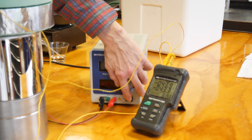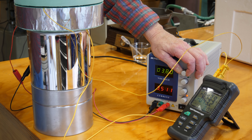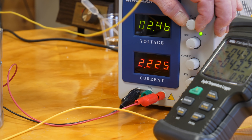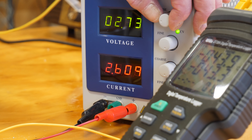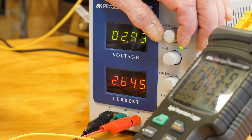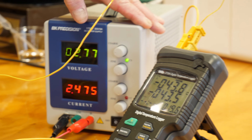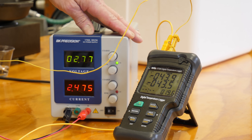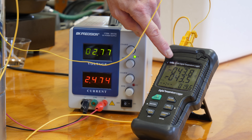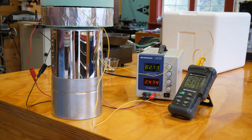The temperature is just about at equilibrium, so I'm going to turn on the power supply. Because resistance goes way down with decreasing temperature, I have to adjust the driving voltage down to get approximately 6.4 watts — about 2.7 or 2.8 volts at 2.5 amps. That's about the same power as before. We're going to see how much colder we can get T2 compared to T1 — the bath temperature — and whether we can achieve the same 15 degree differential at this much lower global temperature.